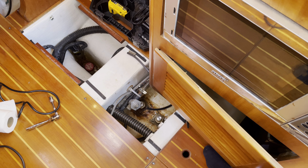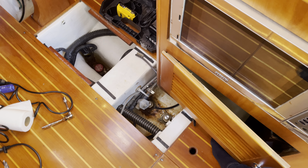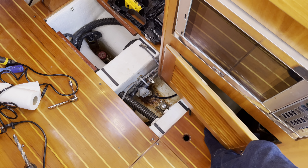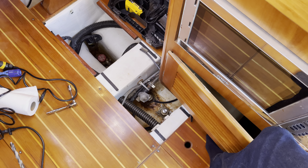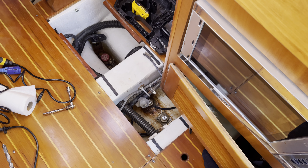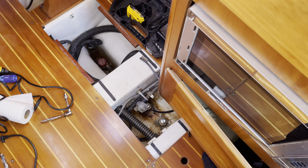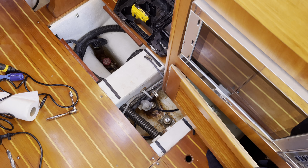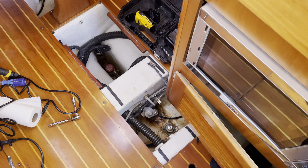I'll possibly check in later and let you know how it goes. Right now we have giant boils on the keel from it being the grounding point for everything — if there's any stray current in the marina, that's part of the circuit. Our lead keel. Trying to solve the different issues of galvanic corrosion — I think this is going to work while also not killing us. See ya.